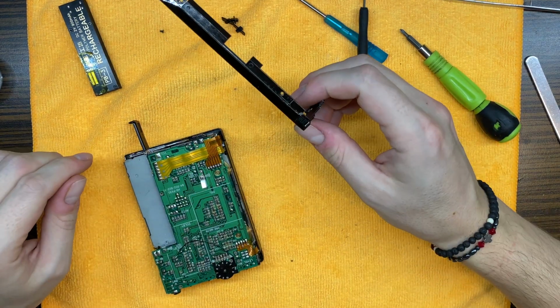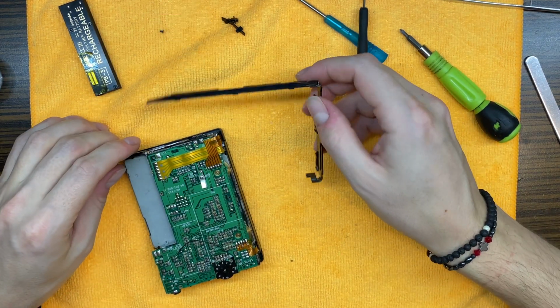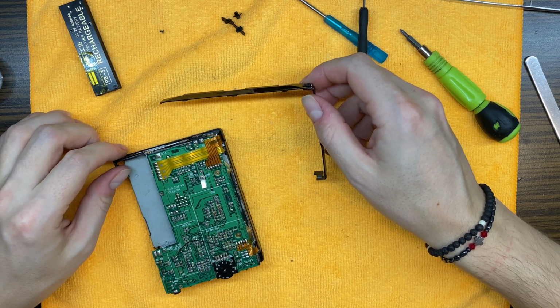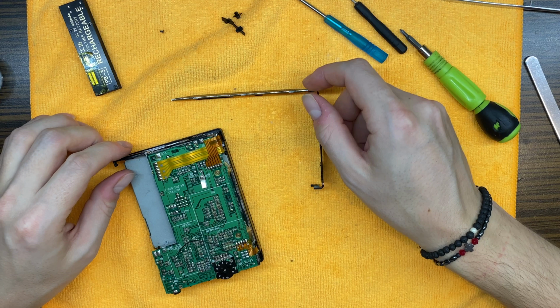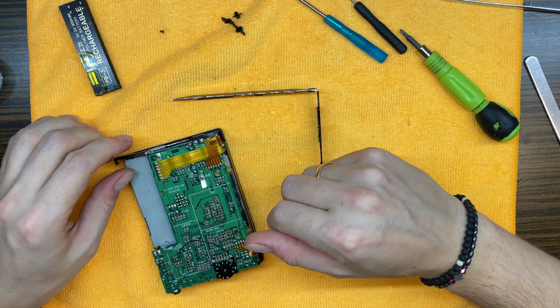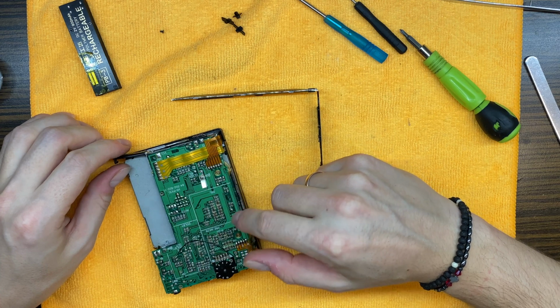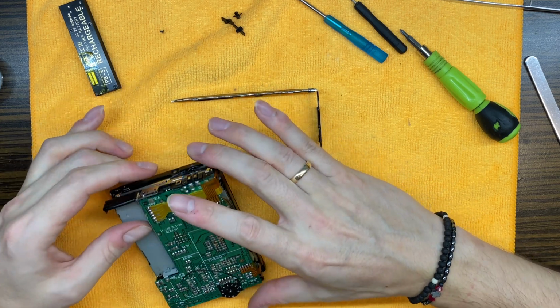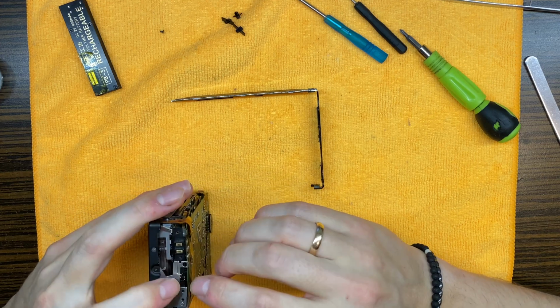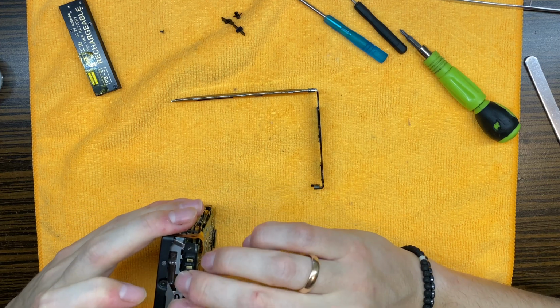So what I would like to do now is assemble the device a bit so that I can set azimuth, dolby levels, then tape speed, and wow and flutter also. So maybe let's do that.